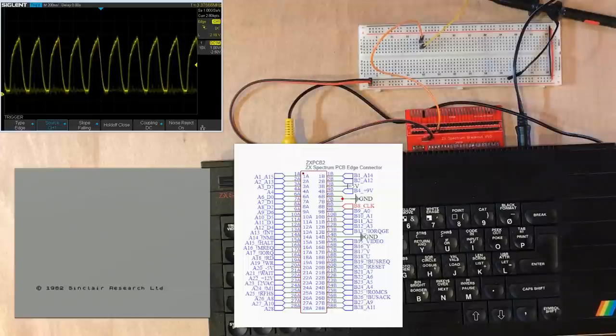The other thing that does jump out to me is that clock does not look like a nice clean square wave. That is a reminder that we are sometimes quite spoiled at the quality of parts we're working with in the more modern builds. I am curious about the way there are sections of the clock that fill in the gaps underneath. That implies sometimes the clock stops on a low signal. Maybe we'll find an explanation for that later.